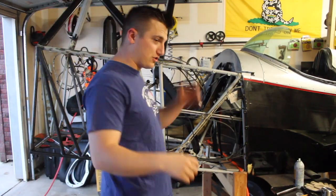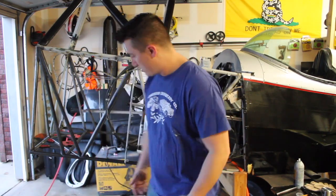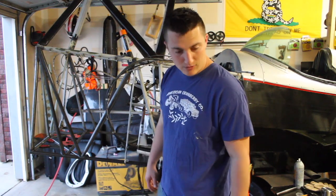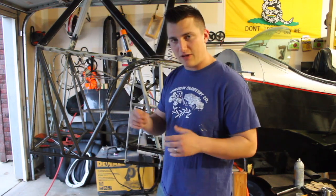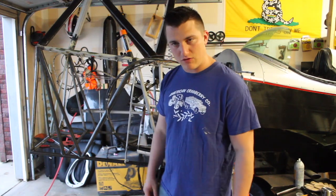Anyway, sorry I didn't need to show you every bit of detail for that, but I wanted to fill you in on where we are. Now we're making some more tubes — I don't even know if this is gonna end up in a video or not, probably not, maybe. A little prep for the tubes here — making sure there's no gaps any bigger than a sixteenth of an inch, which is the size of the filler rod that we're using.